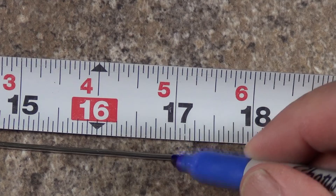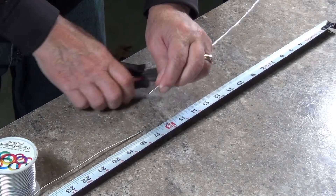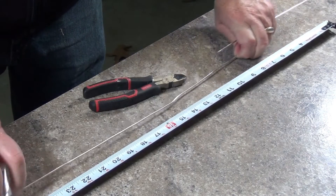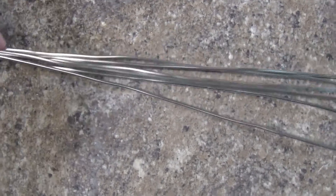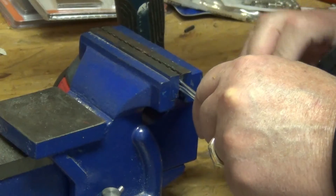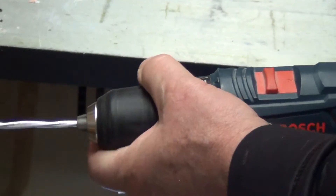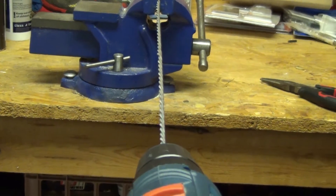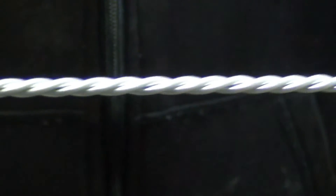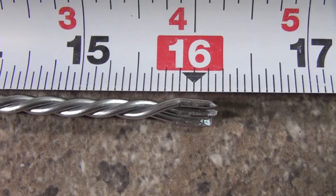To give myself some working room, I cut the element wires 2 inches longer than the dipole length. My dipoles are 15 inches, so I cut 6 lengths of wire 17 inches each. I even up 3 wires on one end and lock them in a vise, then place the other end into the chuck of a drill and secure it. Applying a bit of back pressure, I slowly twist the wires into a cable — just enough twisting to keep everything straight and together. I repeat the procedure with the second bundle, trying to match the same number of twists. If I measure the bundles, I've lost 3 quarters of an inch in length — that's why I cut them long.